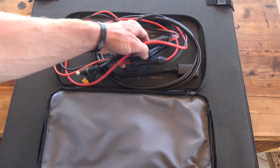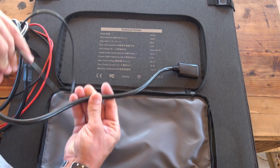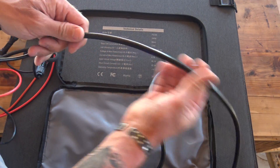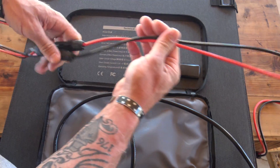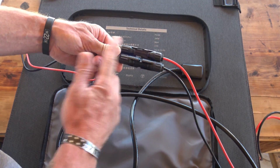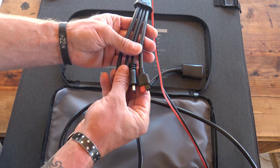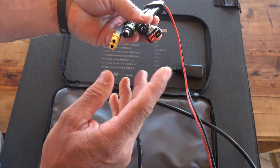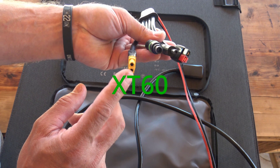When you open the pouch, you can see the junction box has a really thick, heavily insulated wire. At the end it has MC4 connectors — and that's where the solar panel itself stops. Everything past this is stuff I've added: a little adapter that will fit just about all your standard solar generators. You've got Anderson, 5.5x2.1, 8mm, and another popular connector type.